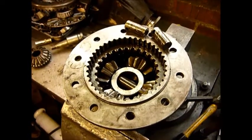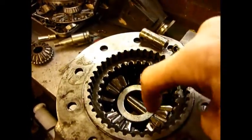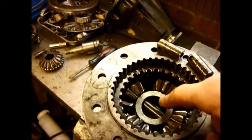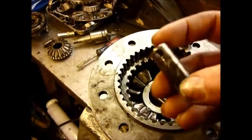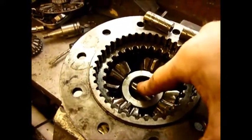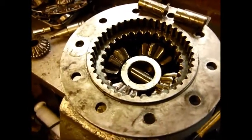Some time later, we've finally got to the bottom of what's going on. There is a big long pin that runs through here and there are two short pins that run through here. At the beginning I said I was a bit concerned there was a pin sticking out — well, these aren't short pins. This is the long pin that has sheared off at both ends and the centre is still stuck in there. This is going to take some considerable time to take apart and look at what the damage is.